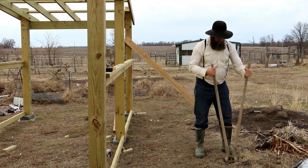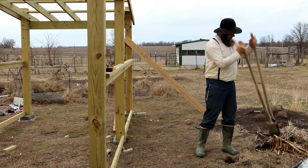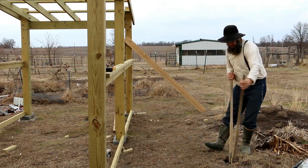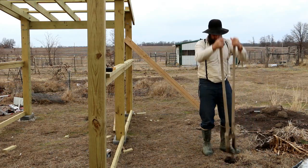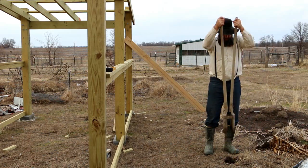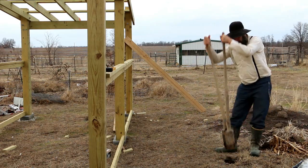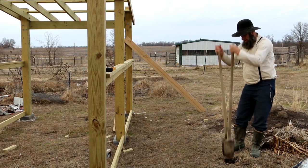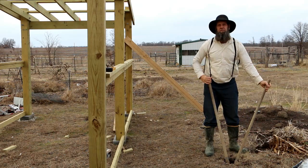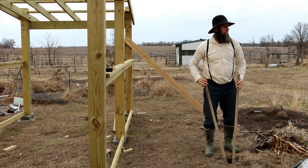When you dig in this kind of ground, because the ground's thawing out, it's pretty nice digging right now, but they call this pie and cake, because it's easy to do. So I'm gonna go down about 3 feet, which is well below our frost line here in the Midwest, where I live, and we're gonna get these posts put in and set. The next video will be pretty much us starting to wrap the building with the TUFTEX panels. We'll be using TUFTEX panels for the greenhouse on this application.